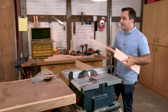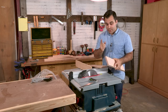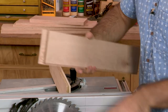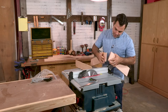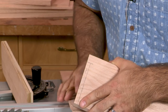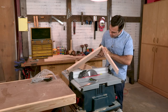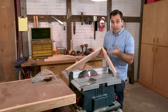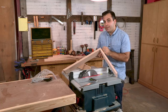We're back from lunch and ready to make the notches in the top and bottom pieces that will give room for our custom hinge mechanism. We have all the rabbets in the long cabinet pieces. The notch depth gives us three eighths here, and the length of the notch gives three quarters of an inch for the hinge. The quarter inch back will run all the way to the top and bottom of those pieces — it's a shop cabinet so we're not too worried about it being fully rabbeted in.